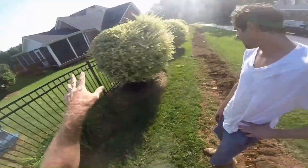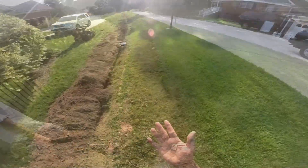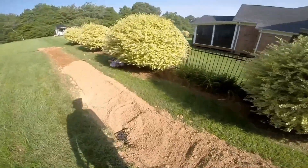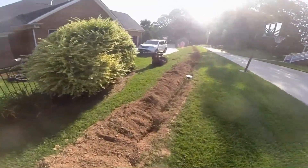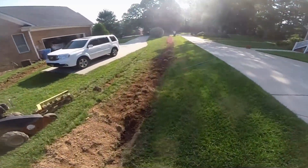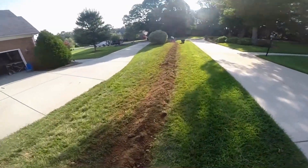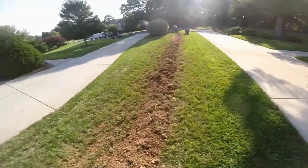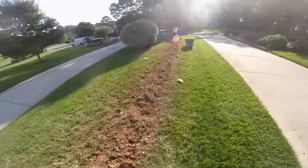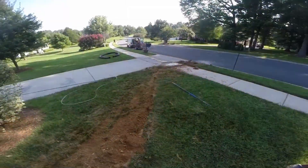Creating that bowl is needed to collect all that water as it comes down the hill — it's very important to get that at the right depth. You can see we've also removed quite a bit of soil here. It's only about 9:30 and we've left a small amount — we're going to pull a little more of that away. But we need that berm so that water follows our line and drops into the catch basins. Remember, when you're collecting immediate surface water runoff you need catch basins, and this already has some slope — some downhill fall — from that low spot in the backyard out to the street.